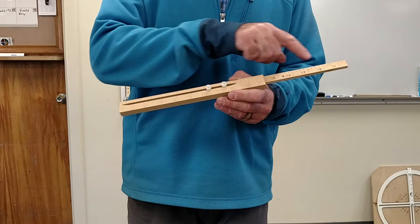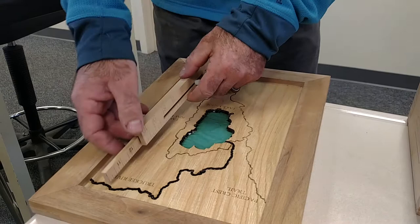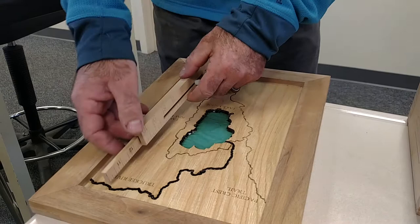This is a 10-inch rule and when it extends out it'll be 11, so measuring this way I'd be at five and a half for that width. And if I'm doing inside measurements and want to find the inside measurement here, I just fit it inside the box, lock it in place, and transfer that measurement anywhere. The sliding rule.